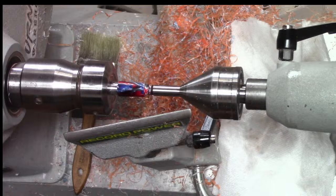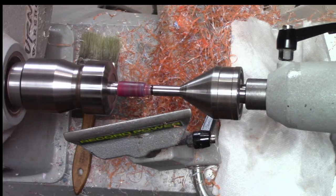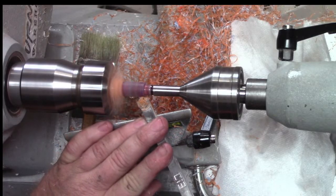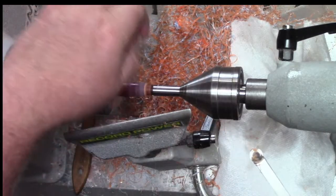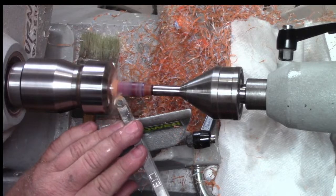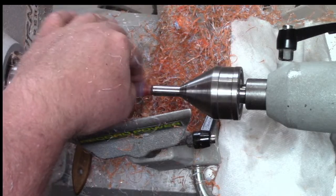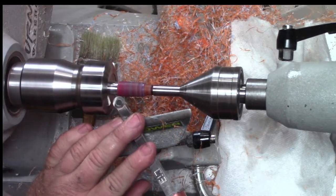We got a question, go ahead. Brett says, jumping the gun here, but what adhesive do you recommend for roll stops on caps? So the question was, what adhesive for roll stops on caps? Pretty much all I've ever used is 2-part epoxy. You could probably get away with thick CA, but you have a little more time and control with 2-part epoxy, so that's why I've done it. I've glued a variety of materials that way. I did a couple of honeycomb casts with a brass roll stop that I cast, and I 2-part epoxied it, and I never had issues with it. I've done wood on resin, resin on wood, so it works pretty well.